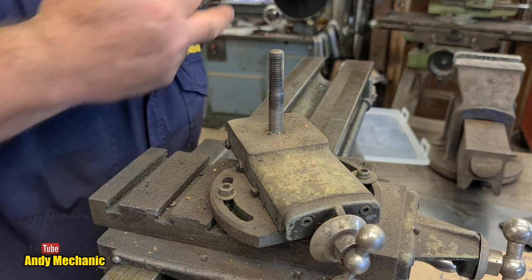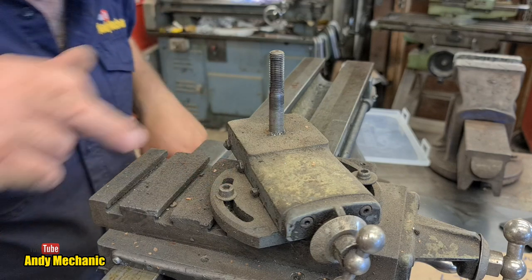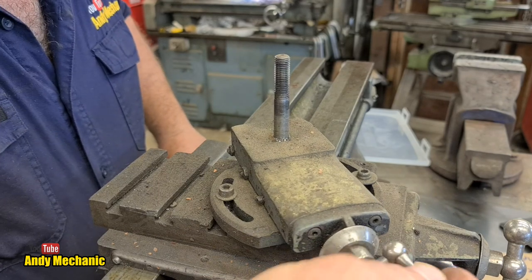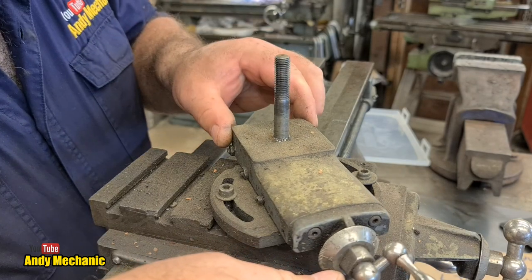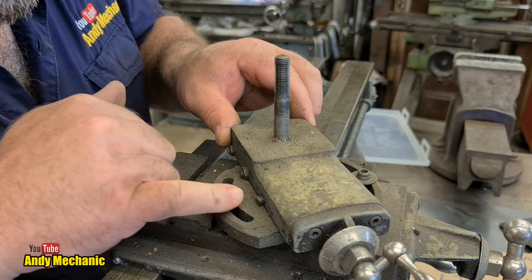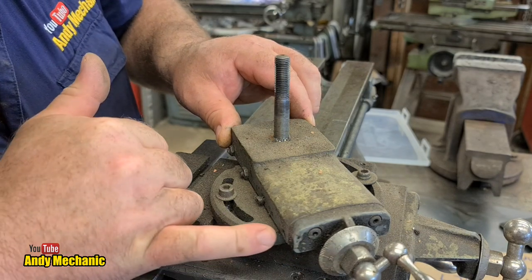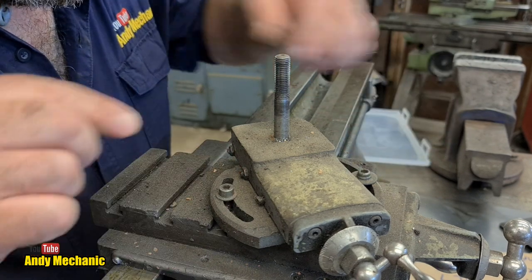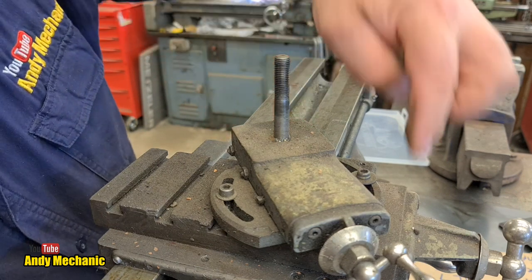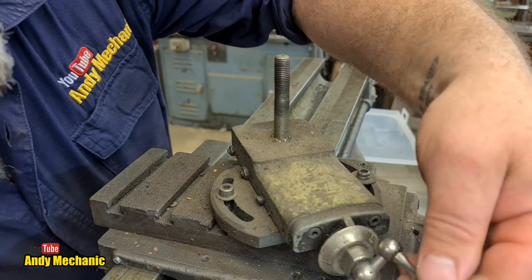We've got the swivel. We could probably get that bit off the swivel because obviously it goes forwards and backwards - that's the whole idea. But you can see there's a lot of movement on that. Now there are some adjusters - in fact that one there has lost its little lock nut by the looks of it, so it probably could be adjusted. In fact that adjuster there is completely missing - there should be four. We've got some screws on the end there as well and we need to get the little handle taken off. Even that's come loose.